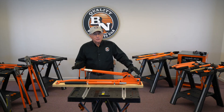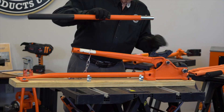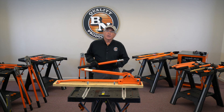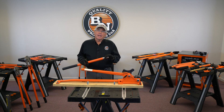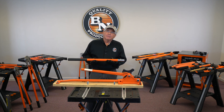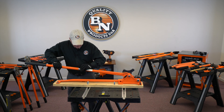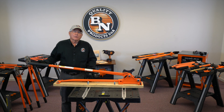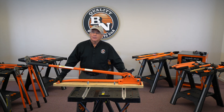The shorter board makes it easier to ship and store in your racks. The handle now comes as a separate piece. One of the problems with any manual rebar cutter bender is that the user tends to put a cheater bar on the handle, which ends up bending the handle and then the tool doesn't work anymore. So we kept the same length of handle but made this section solid steel. When you attach the unit and lock it into place, you get a handle that's even longer than the board — 20% longer than the competition — making it easier to both cut and bend. And it comes already mounted on a board, ready to use in the field.